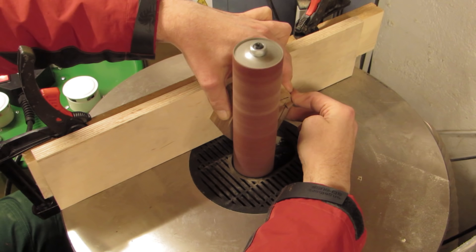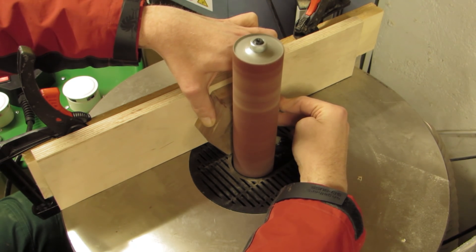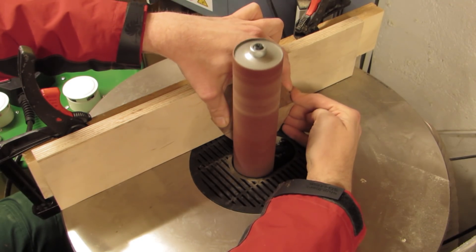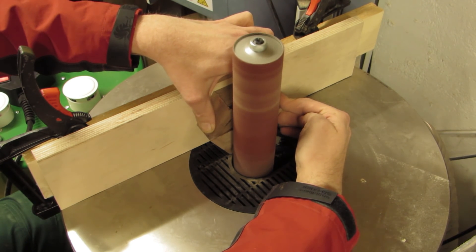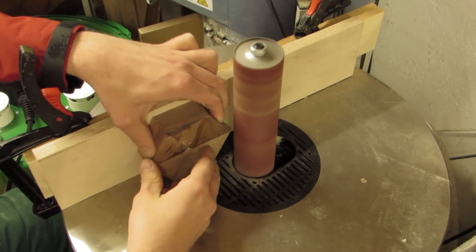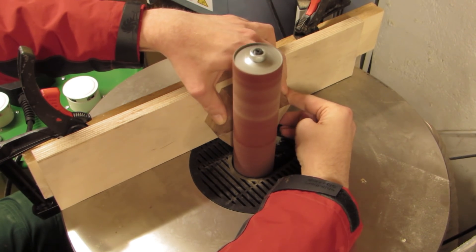This also goes for the hinge. The one I used was a heavy-duty outdoor kind of hinge not made for precision work, but as long as it does not wobble and I apply even pressure, it works just fine. Also keep in mind that sanding is about the hardest way to remove wood in large quantities. So if you need to remove a lot of material, maybe use a saw to re-saw the piece before you flatten it with this jig.